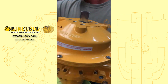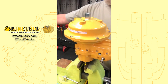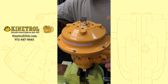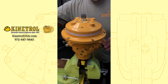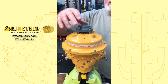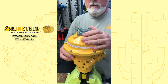Usually turn your pressure down to about 30 or 35 PSI, something like that. As you bring your pressure up it's going to move back and forth, and what you want to do is achieve the center of the actuator. Then we're going to put a spring keeper right on here — you've got to get it on there just perfect to be able to get it to start.